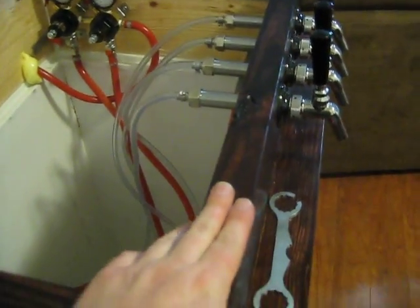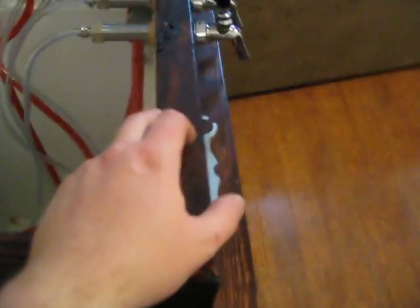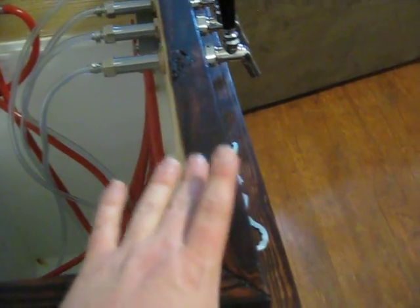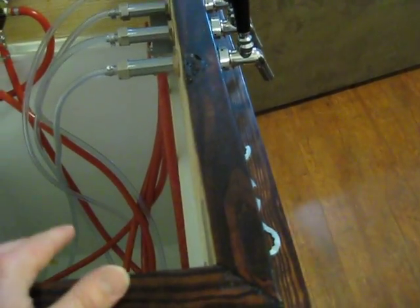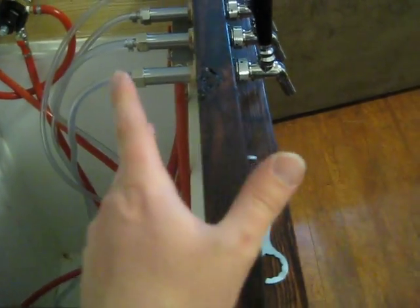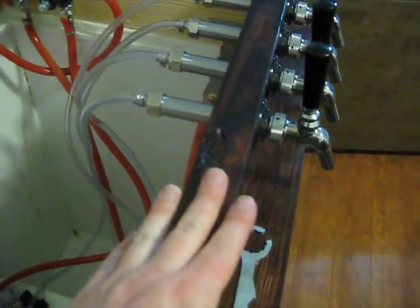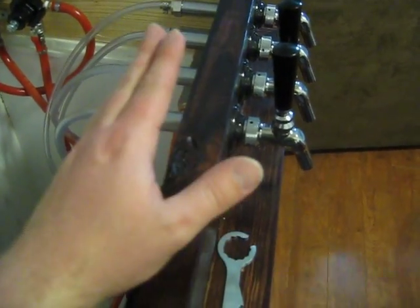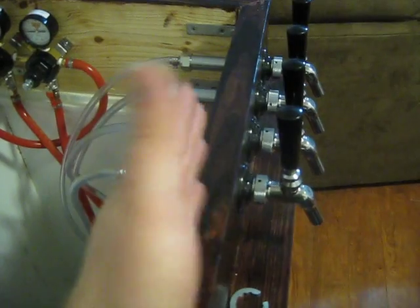The other thing I would say about my whole experience was the collar. I would highly recommend that you stay away from dimensional lumber. If you can find finished, more finely milled lumber at your big box store, I would highly suggest that you use that, even if it means you have to glue two pieces together side by side to get this kind of thickness. Not that you really need this kind of thickness, frankly. The reason being that structural lumber is not very well jointed, and it's definitely not planed. It is, but it's very roughly done. So you get twists, you get bows, you get all sorts of things that eventually make it impossible to make this entire thing a flat surface for this lid to come down and land on.